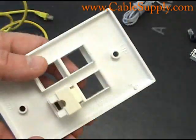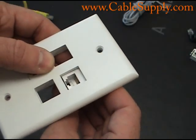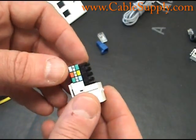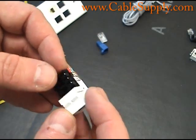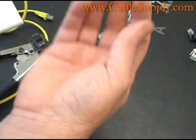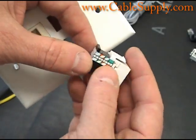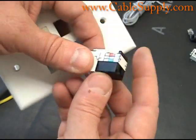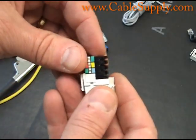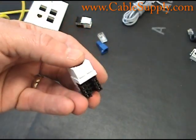Here's a modular — what they call a keystone jack — for the RJ45 jacks. They just snap in there like that. This is a keystone jack. Actually, this one I'm looking at is an RJ11, but it also is a modular plug and snaps right in. Here's the RJ45 keystone jack, and if you look, it has the color code right on it — so you don't even have to look it up on the internet; you just use the color code to punch it down.